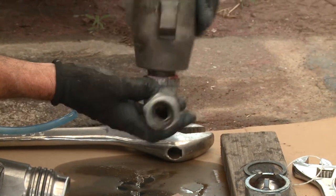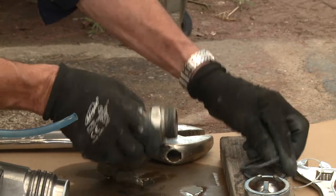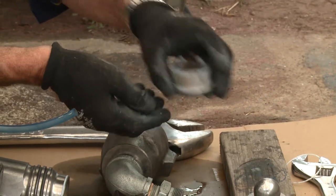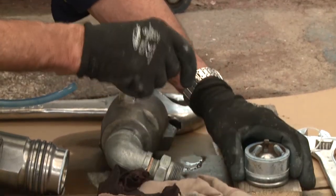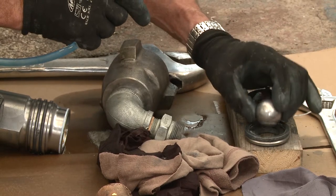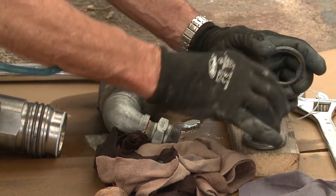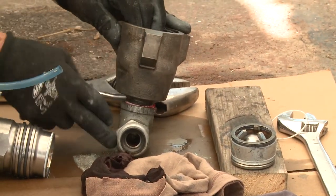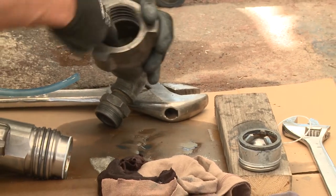The three shims do two jobs. One is ensuring sufficient pressure on top to hold the seat down. The other is orientation: when we undid this it was pointing out the front of the pump. If you forget to put one shim in and reassemble, the suction pickup section could end up at three o'clock instead of six o'clock. The three shims are essential to ensure the pump faces the right way. They sit on top of the cage — not underneath. If placed underneath, the ball gets more travel and can cause cavitation with high-volume solid products.